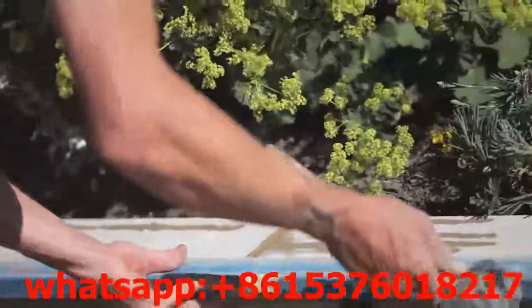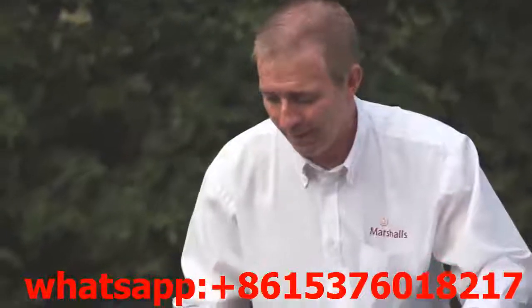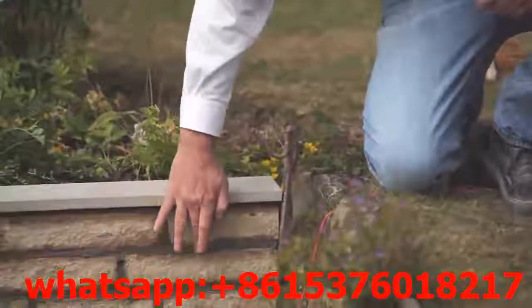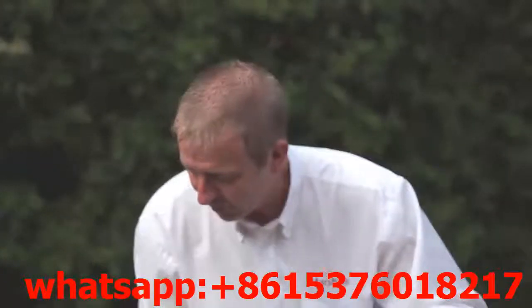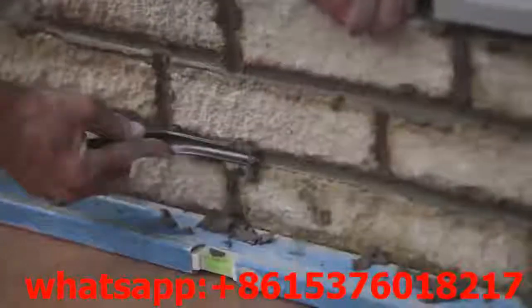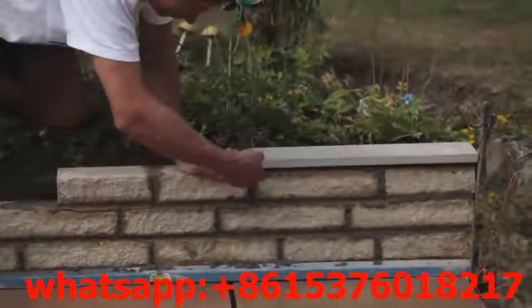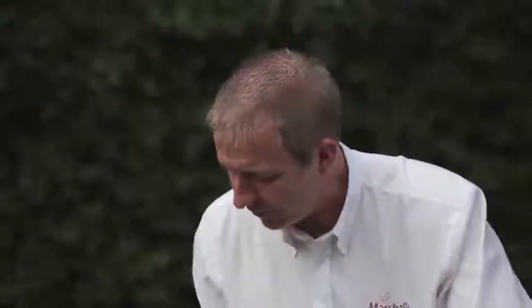Job done, looks beautiful. Once Matt's put the wall up, you see the joints — what you'd normally do is strike that off with a jointing iron. This is the joint we're going to use, and depending on the weather, we touch the point just to see that it's got a bit of resistance — not too wet, just nice and dry. Then Matt will point it in. This gives a nice finish to the wall and also a nice recessed joint which shows the wall at its best. As he's striking it through, you get the snots onto the pavement — you just clean those up. As you can see, it's pretty dry at the moment, which is nice, so you get a nice textured finish. Once Matt's finished all the pointing, he'll then get a soft brush and stroke it over the face of the wall to take the rough edges off and give a nice textured finish.